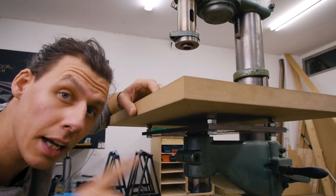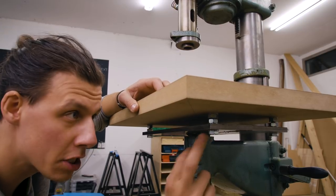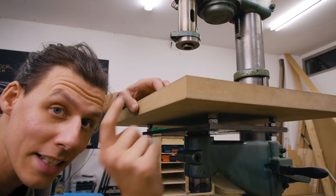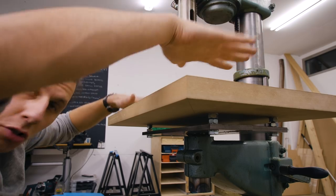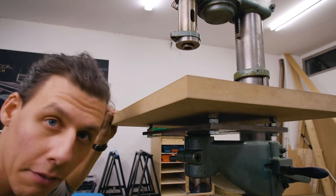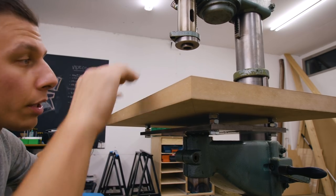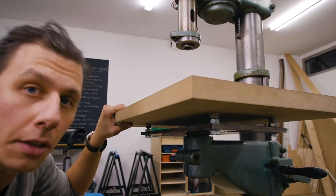The way it's going to work is that this bolt spins freely in the steel plate, and if we turn it, it screws more or less into the threaded insert in the MDF - that way we can adjust all four corners to be completely level. For now it's just test assembled. We're going to take it apart again, put some oil on the top, round over the edges, and maybe paint the edges as well.